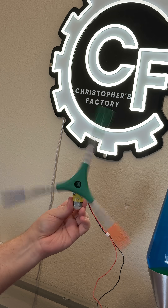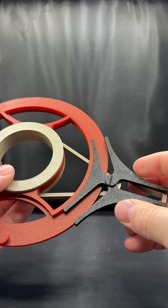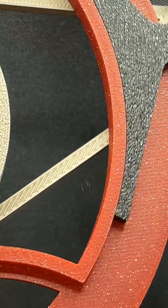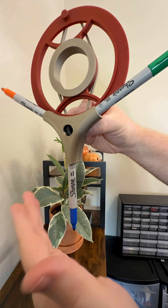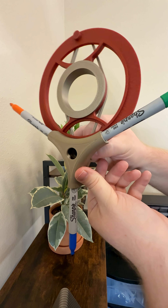With the Geneva mechanism, though, once it has completed a rotation, the Geneva wheel sits flush with the cam wheel — this little raised part here. This is that mechanical enforcement. If it was linked to a motor, there's a strong chance that while you're drawing or cutting, if the force is greater than what the motor can withstand, the tool head might rotate and then everything will be messed up. With this Geneva drive, though, the pieces are geometrically locked together.